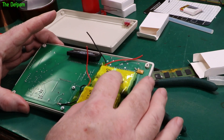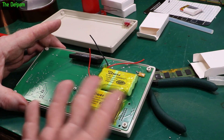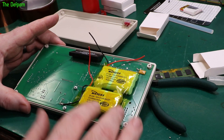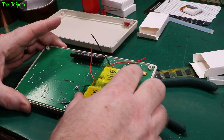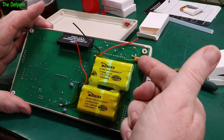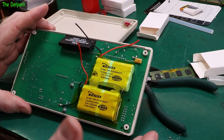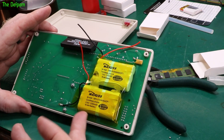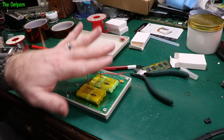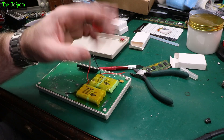Batteries are mounted. I've decided to stick them on the board instead — if I do it on the casing I need to run three wires over; here I've only run two wires, so it's one less wire and a bit tidier. I'll put some kapton tape over them to add a bit more protection, help tie them together, and stop them sliding on the board. I've mounted a 1.1-amp PTC right here to add as a fuse on the main supply coming in, so at least it's got some kind of protection. Being a PTC means it will reset itself when it cools — it won't be a permanently blown fuse.